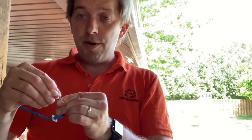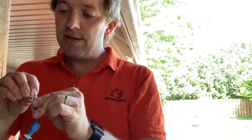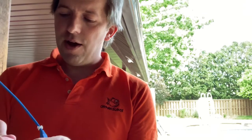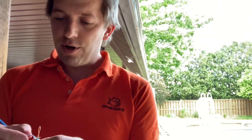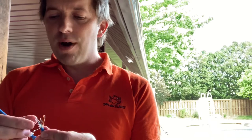But one of the other nice things about this access point is it is power over Ethernet. So I will not need to worry about delivering power to it. I have a Unifi switch that delivers PoE. It's recommended you have a surge protector on both ends of an Ethernet cable like this, especially between two buildings. You know, there's a chance that you could fry all your network equipment if one place gets struck by lightning, electrical discharge, or whatever. So I looked them up, the ETH-SP, they're about 20 bucks. I'm just going to go ahead and add that to my network. In the meantime, I'll be living dangerously. Definitely recommended over a long distance between two buildings. An Ethernet cord should be grounded, should be surge protected.